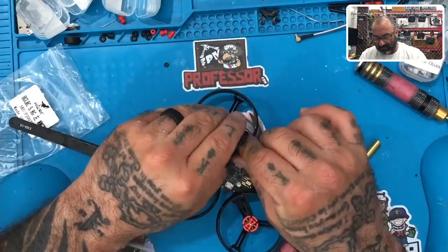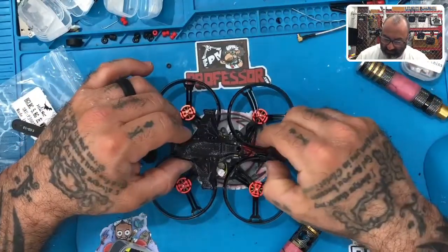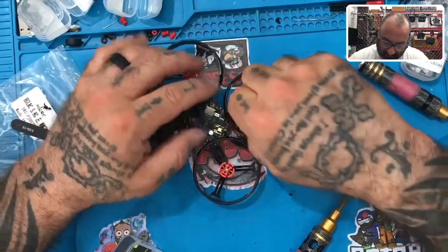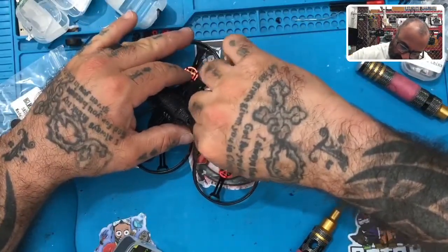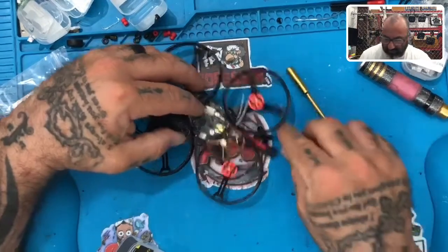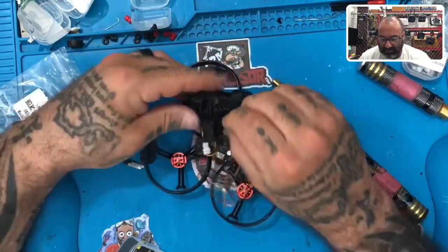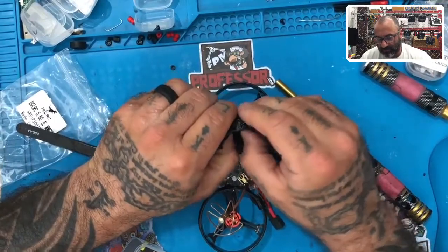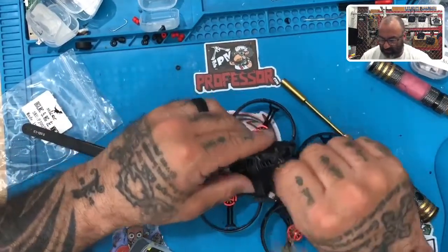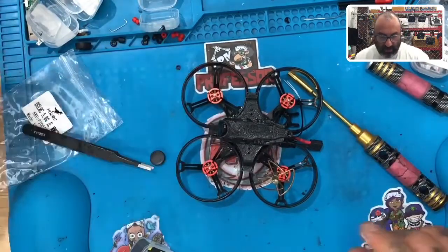For me I just want to make sure I have enough space. Now they give you this piece as well with the kit that goes on the back right here, and then your antennas come out of that. But we still have to put this antenna in. What I would suggest is let's go ahead and clamp this antenna in as well — this is your MMCX connection. You can fit it in here and snap it in just like that. I'm going to place this receiver up in this area. I'm not going to hot glue it yet because the customer still has to get it out to bind it. These wires will go up in here as well. We are going to get ready to screw this down.